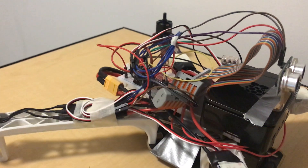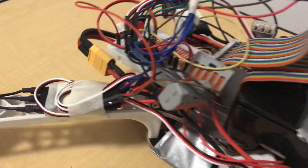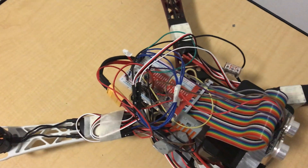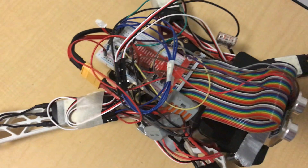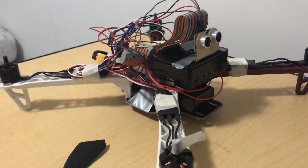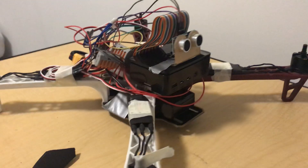The hardest part about this project was definitely the wiring — you can see it's a little disorganized right now. I had two long wires and also two short wires, so I had to kind of improvise with some connectors. But overall I've got all the ESCs and the motors connected in parallel from the LiPo, and then I've got the wires from the sensor going to the Raspberry Pi as well. The wiring was definitely the most complicated part, but it turned out really well. In future prototypes I wouldn't be using tape — I'd be soldering as well.